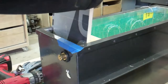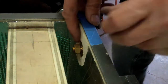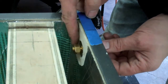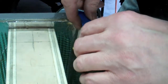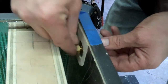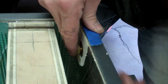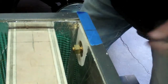That should do it. As you can see now, I can attach my terminal from here, the negative on the battery, down into this area here, and there's no aluminum foil there in this area now, and that will give me a nice through the wall of this box connection point for my cables on the other side. I'm going to do the other side now.